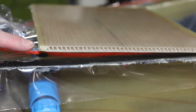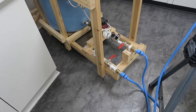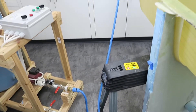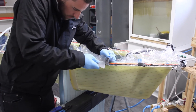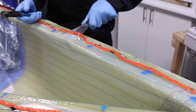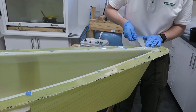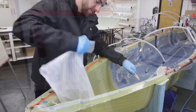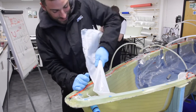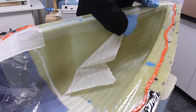The mould is a sandwich of channels that allow hot water from a portable heater and pump to circulate freely through the core to achieve the post-cure. With the moulding now fully post-cured, the bag and mesh are removed — a time-consuming process with little opportunity for recycling the materials. The moulding may need to be prised out using wedges; on very large mouldings, water is pumped in under pressure to achieve separation. The peel ply is removed once the moulding is released, leaving a roughened surface as an ideal key for any further epoxy work, fairing or painting.